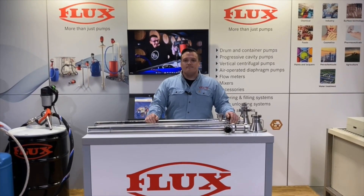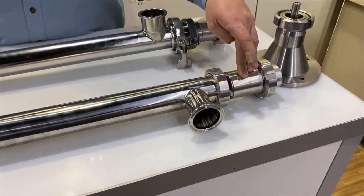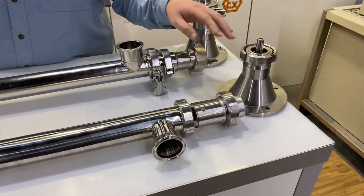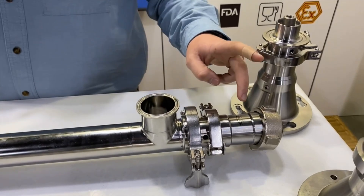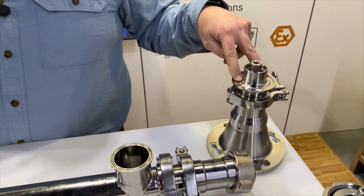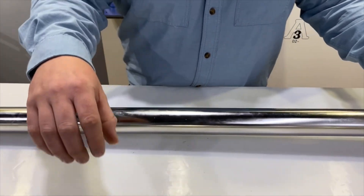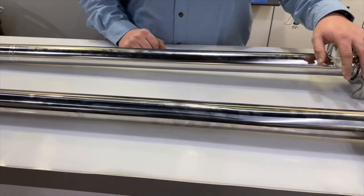We'll start with the F560 GS 5426 — the GS indicates that it has a gearbox. The same pump configuration is also available with an S flange, which would be the F560 S. The pump we're comparing it to is the Visco Power F570; the 570 indicates it has a gearbox, and the same configuration is available with a bearing flange, which would be the F580. This pump has a closed mechanical seal, indicating it's for sanitary applications, whereas on the 560 series, the 560 is for sanitary and the 550 would be for industrial.